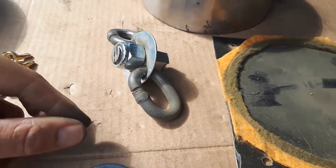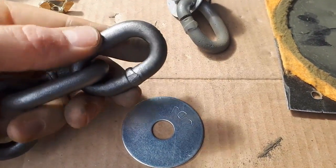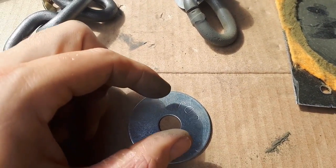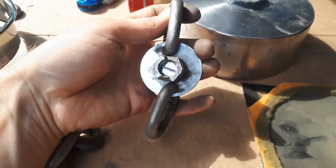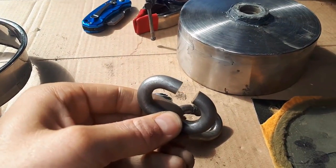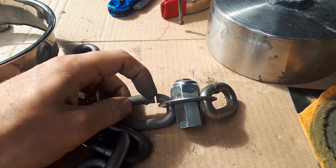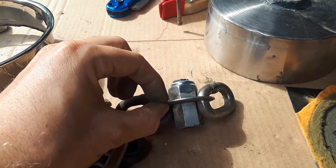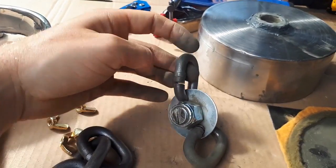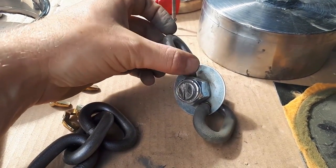For the fender washer, bore out the center hole with step bits if you can't find one the right size. On either side of that center hole, drill another hole that's three-eighths inch to accept your piece of chain — and you want those holes directly across from each other. If they're not directly across, the weight distribution will be uneven and that'll cause your crusher to vibrate. For the chain links, cut them right out to free up some whole undamaged links, then use your cutting disc to make a single cut in a chain link just wide enough to pass through the washer — that way you can slip them on and off easily but they won't come off during operation.